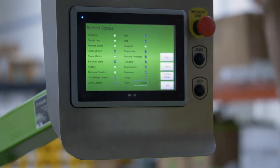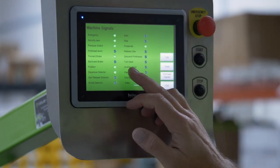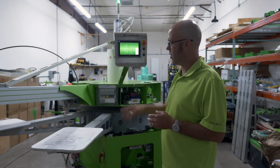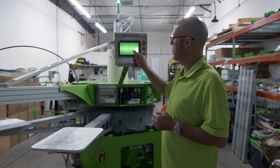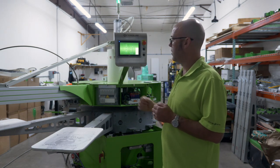Descend printheads — when your lifting tower is in the down position. Turn back: if you have an inverter alarm, all your inverters with the exception of the rotation inverter are located on the back of your print arm. There's also a red light on each print arm. If you have an inverter alarm, walk around the machine — more than likely it's one of your print arms.